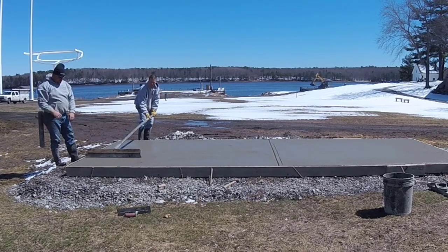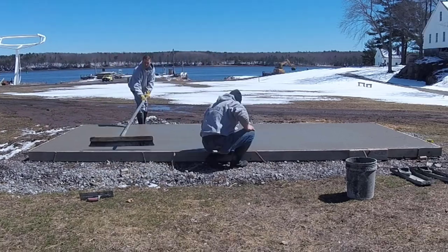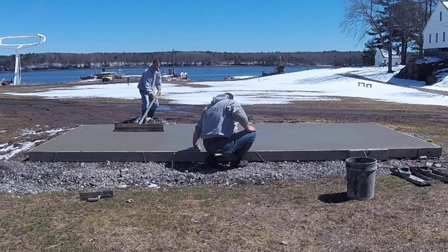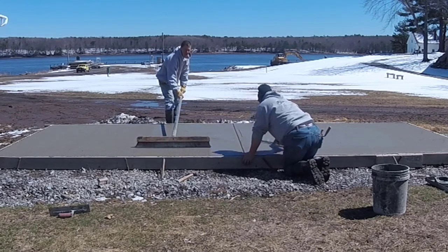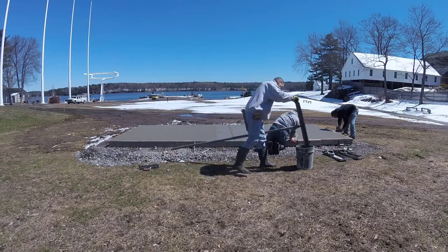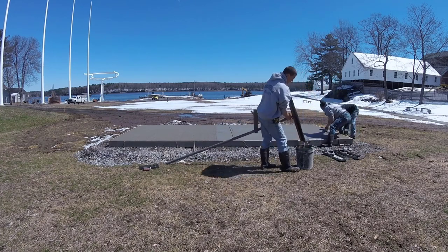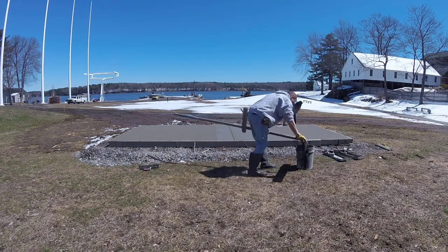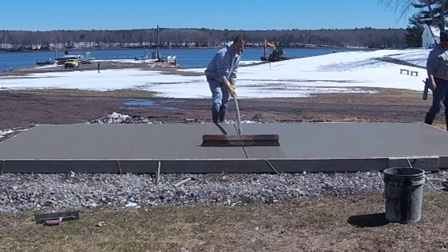We'll run the broom over it like this and take a look at the broom marks — if they look good and they're fine enough, not too rough, then we'll just keep going. If not we'd float those broom marks back out and wait a little bit. This one seemed really really nice so we could go right to town on it, then get back over to those other ones in the shade and redo the tool marks. Once you do a few passes with the broom, paste builds up in the bristles and it starts leaving what we call little concrete balls or concrete snots on the surface. So we'll just rinse the paste out of those bristles, get as much water out as possible, and your broom marks will look really nice, neat, and clean.